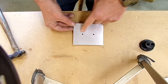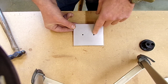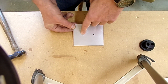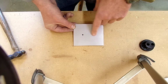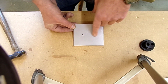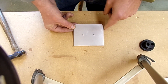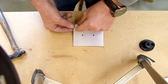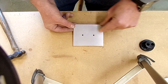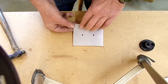I've just taken off the engineer's blue, and that drilled through the holes here at 4.5 millimeters, and then reamed them out to the 3/16, all on the pillar drill to make sure absolutely everything is spot on vertical. I rounded the top corners here because they're not going to be modified. The wing will be mounting up here, so I won't be taking any material off the top.